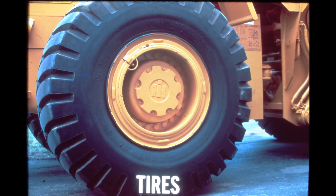The standard tires on the 540 are 23.5 by 25 L3 rock-type tread with a 12-ply rating. Normal inflation pressure is 45 PSI. Maintaining proper air pressure provides maximum road contact and results in increased tire life. Too little air pressure increases deflection, results in extra strain on the tire, and increases the chance for bruising. Overinflation reduces tire deflection and contact area, resulting in rapid wear in the center of the tread.